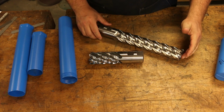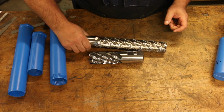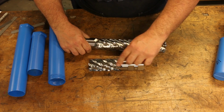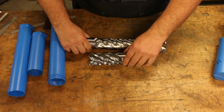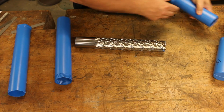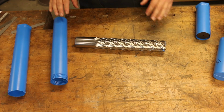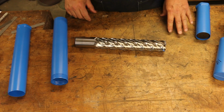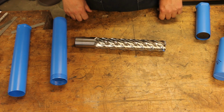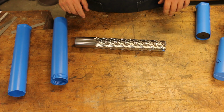And look at this one. That is razor sharp. This one hasn't got the rough cut on there. This is more of a smooth cut. I'm gonna put this up before it gets messed up. But this one here has a radius in the bottom. It's not real sharp, which is actually good for real heavy milling. You really don't want a sharp corner down there. You can do that with lighter milling when you finish cut.